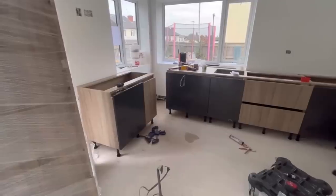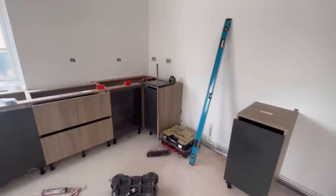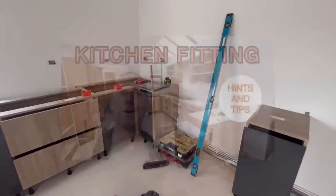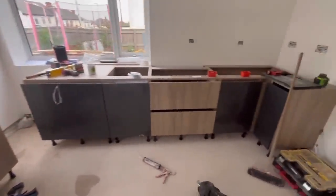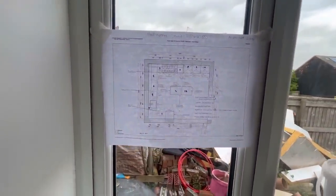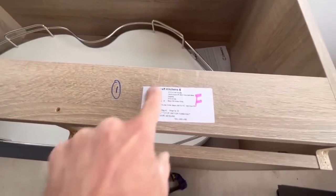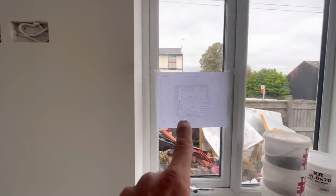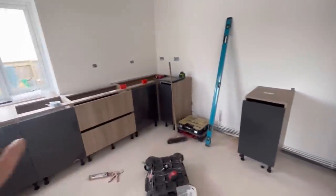It's the first time I've ever done one so I'm looking forward to this. As you'll see I've cracked on - I'm showing you this because we have another kitchen video on the channel already which goes through how I set it out, use the laser, check everything, and mark on the walls where all the units are going. What I did do is get the plan - as I always say on the channel, always trust the plan. I went round and marked the unit numbers in blue pen on top, identifying each code on the unit which corresponds with the code on the plan to make sure I don't put them in the wrong place.